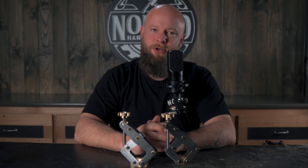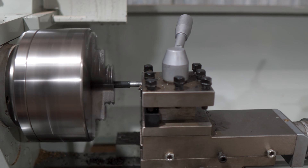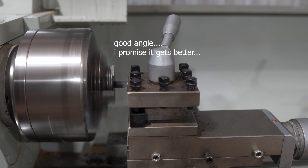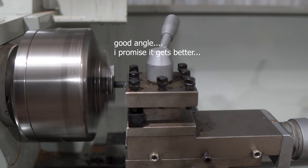This is where my lack of experience in this space is going to slow me down. I'm going to hold the arms of the clamps together with standoffs and bolts, but to make them as rigid as possible I want to insert the ends of the pins into the frame. Most of these style clamps you see are peened over on the ends of the pins to lock them down, but I want to be able to put these together and take them apart to adjust if I need to. So I'll turn down some steel to 8mm and then cut the ends of the pins at 6mm to go into the holes we drilled and reamed earlier.